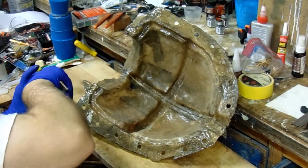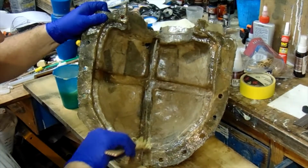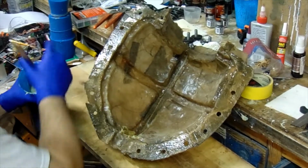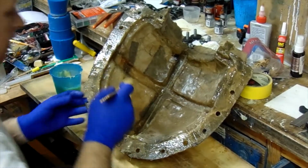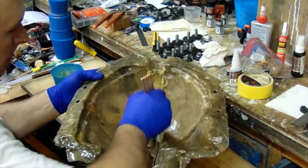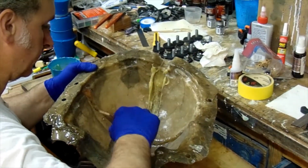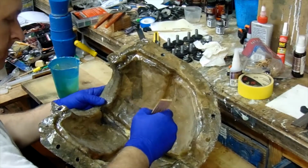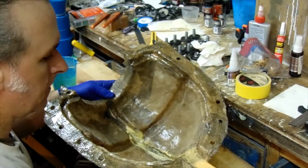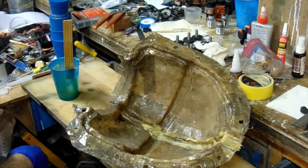Alright, so the reason we're having to use Plasti-Paste on the fiberglass mother shell is that when the mold failed and stuck to the mother shell initially, I actually had to cut the mother shell along the ridge used as a key. This is just done for reinforcement purposes, since I've already repaired both halves of the mother shell with more fiberglass and fiberglass sheets.